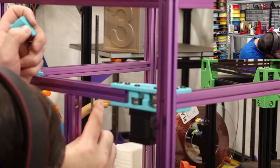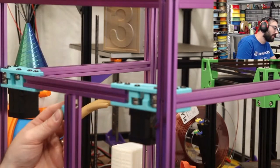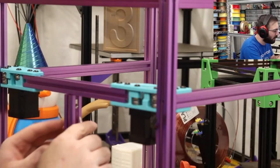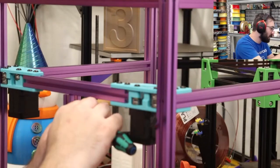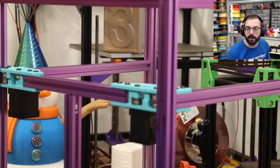And a Rook is cool, but it does use a V0 bed, which is not the cheapest. You can use glass, but you don't want to have a heated bed. So realistically, you're getting a V0 bed, something like LDO's PI bed. And you have that small build volume. What you have is an 8-inch bed.